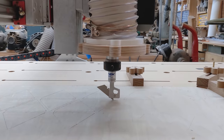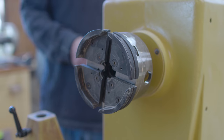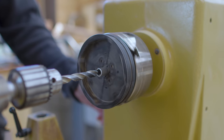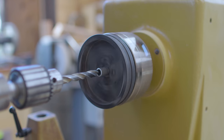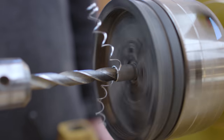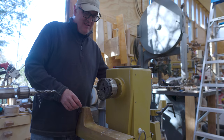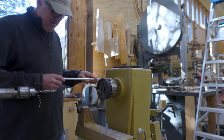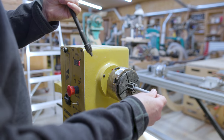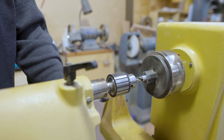After doing this, it worked okay on the triangles, but it was having a hard time with the map. So I decided I really needed to stop and make a pen holder for the CNC machine. What's a little bit tricky with the CNC, especially when trying to draw on plywood, is you need a little bit of shock absorption with the pen — it can't just be held rigid because you'll either destroy the tip or it won't quite touch the material it's supposed to be drawing on.